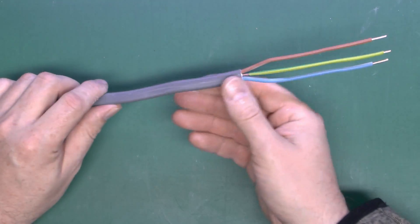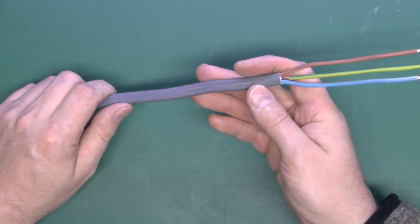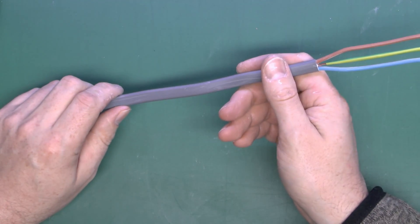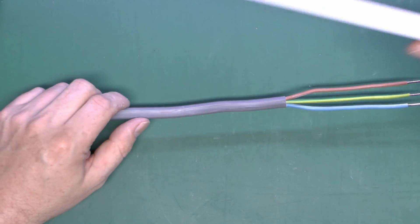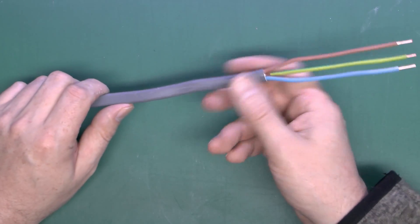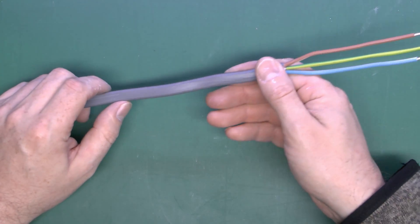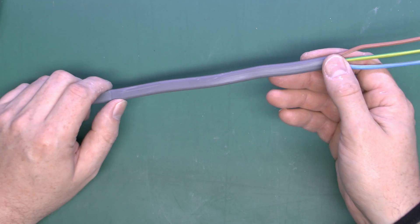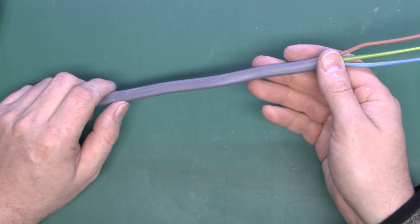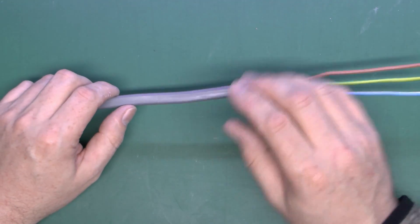For putting cable in the wall — by far the most common option since most people don't want to see cables on the surface — you can cut a channel into the wall and place the cable directly in it, then plaster directly over it. No additional covering is necessary. Alternatively, you can get oval plastic conduit, thread it over the cable first if you'd like — in theory it offers some protection from a sharp trowel edge when plastering. You can also clip it to the wall and put plasterboard over the top, or use round conduit, though that's normally for single wiring.